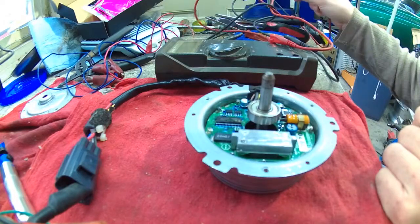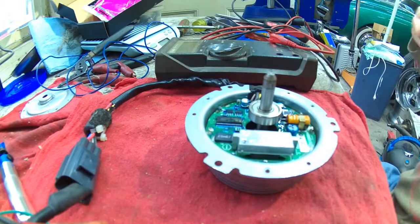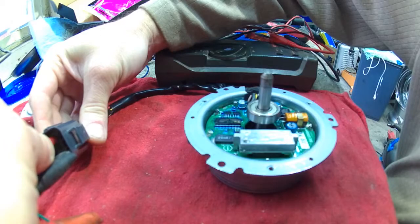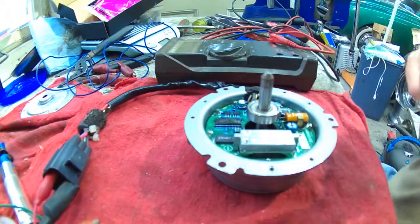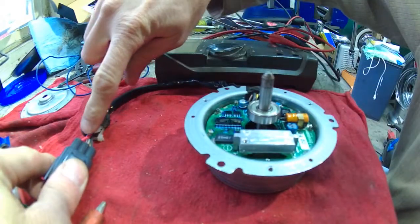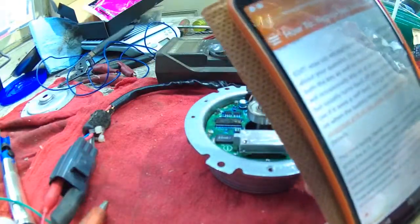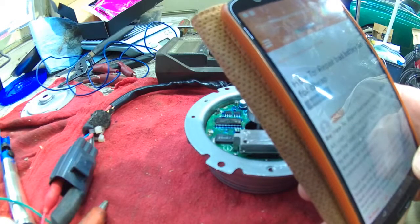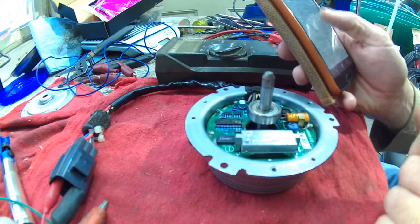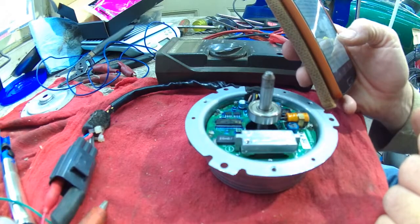The first thing I noticed was that the MOSFET pack underneath that heat sink is the first thing to get hot. We're gonna play with this a little bit and see if we can't get it to just spin. According to sources on the Escapade site, red is power constant and black is ground, which I've verified in the car. Special thanks to betarb24 on the Green Hybrid site - he's the first one to start digging into one of these. He says the blue wire is linked to both the key as well as battery conditions, so that's probably the trigger to fire it off.